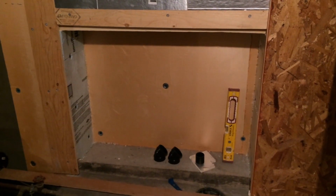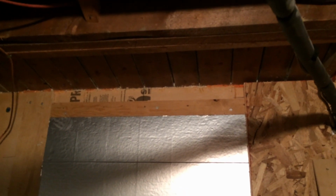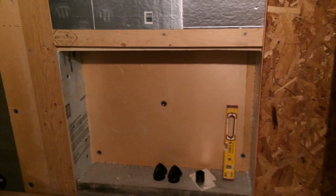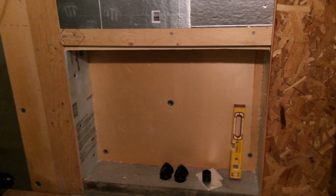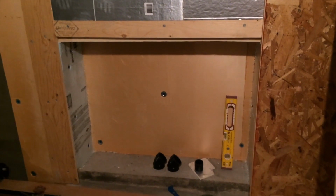This little cavity here was kind of a neat thing. That used to be a metal door with ashes behind it, and in the end it was picking up ashes from the fireplace upstairs, so they would just drop down into the chute like a clean out. But it's a pretty large space, so I decided to keep it, insulate it, and I've worked it into a cabinet design where this lower section will get some drawers, and I'll have about an extra 10 or 10.5 inches of depth in this part of the cabinet here. You won't notice it from the outside, but it'll be very useful storage space.